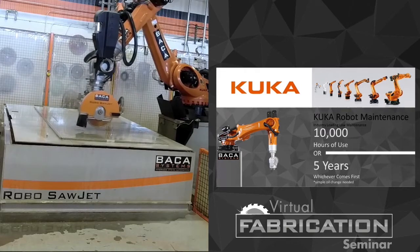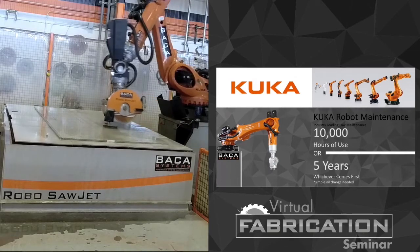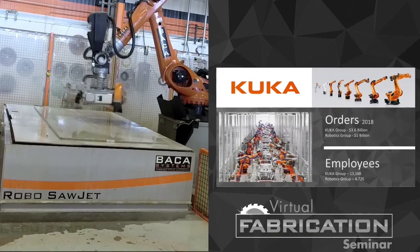It's very, very similar with the robot, where I can take each one of those 6 axes and I can seal those joints. I can put oil into them, and the environment to the stone industry, the garnet, the abrasives, the water, all of that is completely sealed out, and so those joints last so much longer than when you're using those bellows and you're using the gears where you're not able to seal the joints, but you're just constantly pushing oil through to them, and it's getting dust inside of them, and you ultimately end up having to replace them.